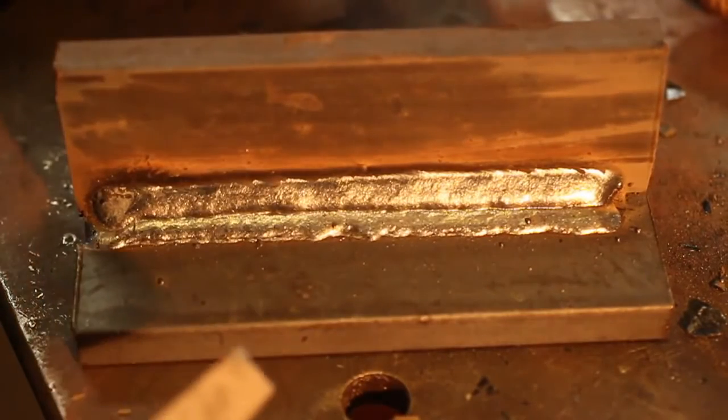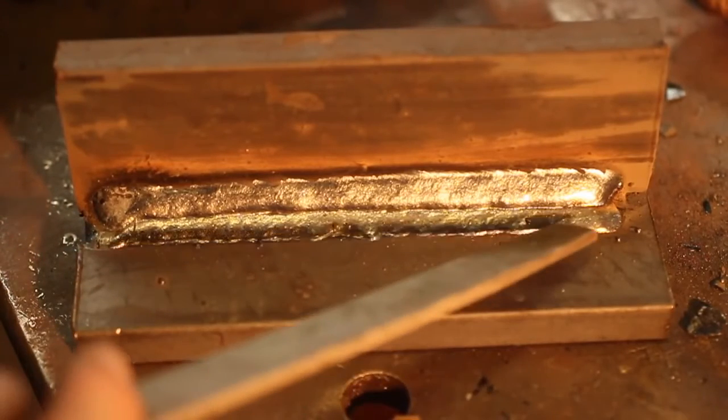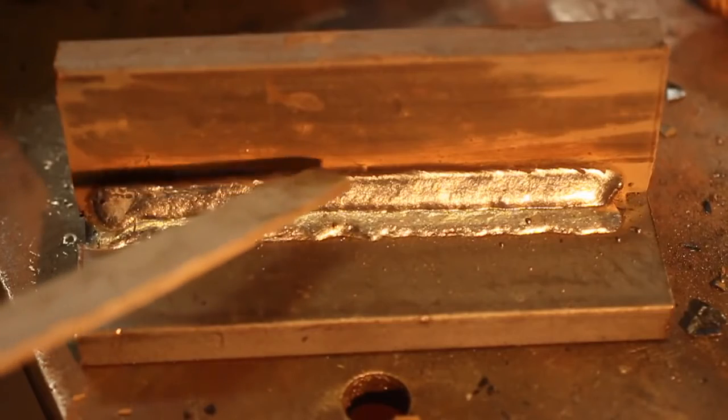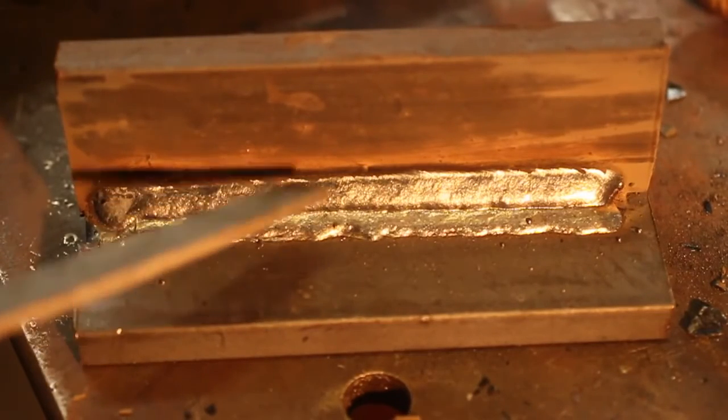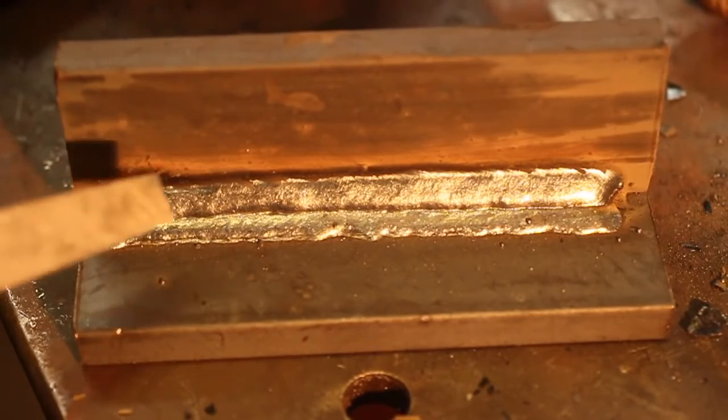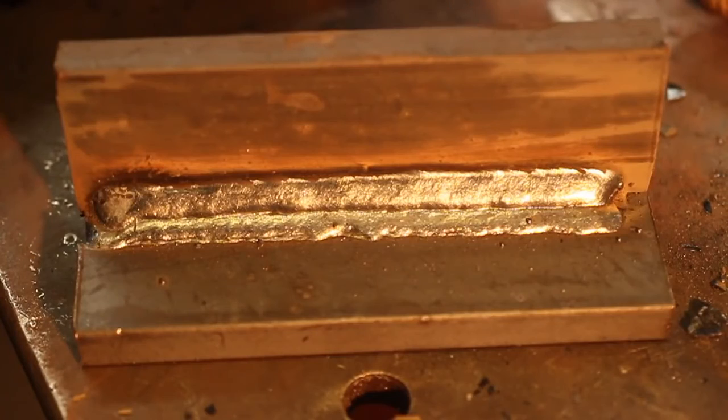So if I were to make this another 3 passes, I would put my first weld here, then I would stack it here, then I would stack another one here, and then I would come back to the bottom and so forth. And obviously the more and more welds you put in, the larger the step count, up to 5 and 6 and 7 welds. But this is essentially what you're looking for in a standard weldment of a 1/2-inch piece of steel on flux core.